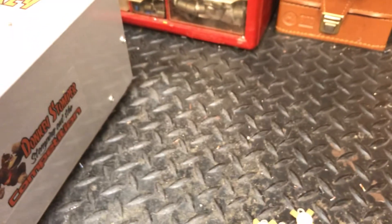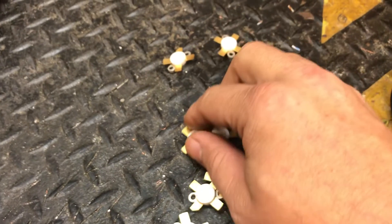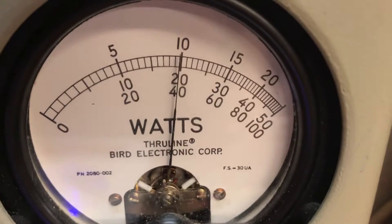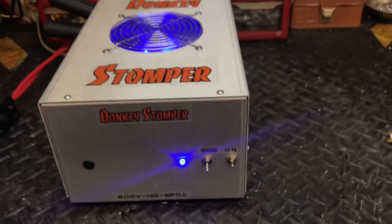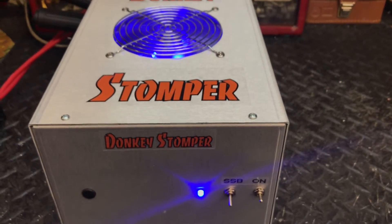I hope this helps you guys. I'm going to remake this video and again I apologize for the mistake. One pill: 25 watts output dead key. Two: 50. Four: 100. Six: 150. Eight: 200. I'll preach this and preach this because it's that easy to make a mistake — just like me misreading that slug. I read it for a 50 instead of a 25 and told you guys it was an 8-watt carrier. If you had keyed 8 watts in your boxes, it would have produced 400 — which is too much. About 4 watts into 8 pills is where it needs to be. This is what I do to keep the boxes working. I hope this helps you guys get a longer life out of your product and get a lot of talk time.